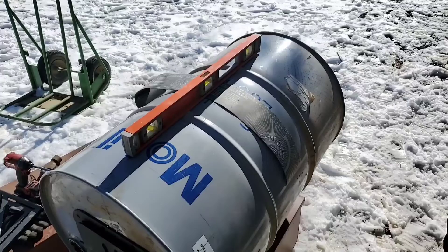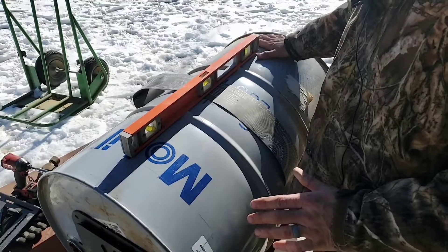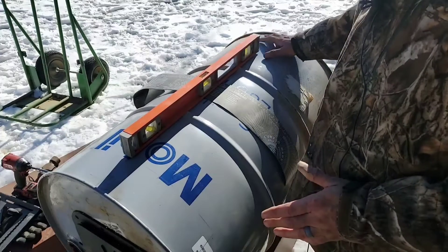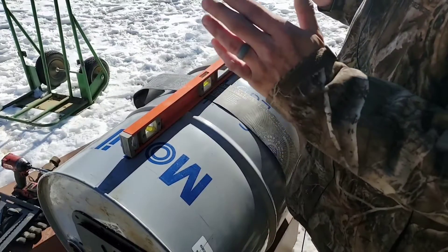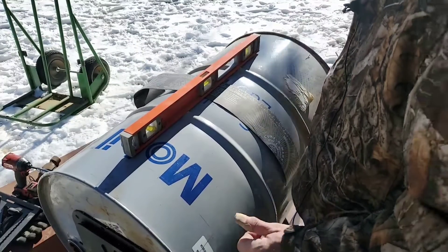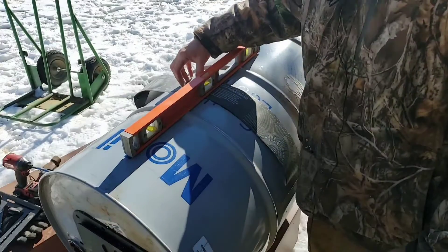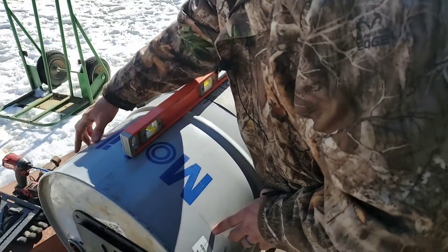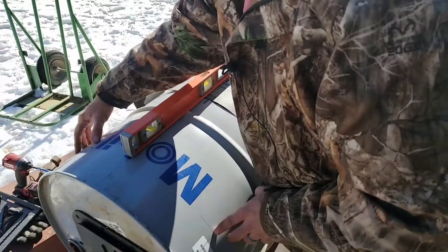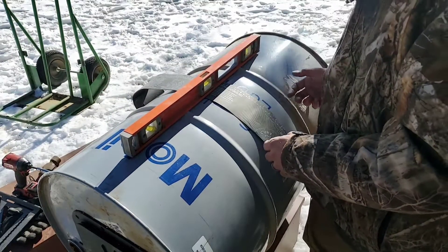According to the directions the next thing is to put the flue collar on, but we're not going to do that because I'm not sure the flue collar will be where I want it once the pan hole is cut — I might have to trim a bit off the flue collar to fit the space. My pan is 24 inches, so I've marked my center line here using my wrap-around, starting at 20 inches — a 10-inch mark on the center line and then 10 inches on both sides of it.